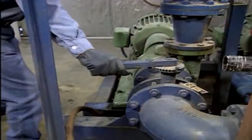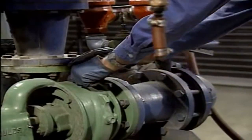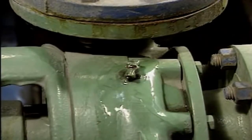If a centrifugal pump is not completely filled with liquid — that is, if it's not primed — it doesn't have the ability to pump liquid. One way that a centrifugal pump can lose its prime is for air to enter the pump casing, causing the pump to become air bound. There are several ways that air can become trapped inside a pump casing. For example, during startups, the casing and suction piping may have to be vented. If a sufficient amount of air remains trapped, the pump will not operate properly.